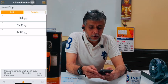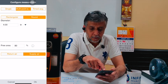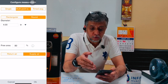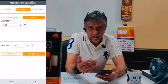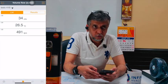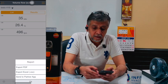To get the air quantity directly, you input your diffuser area by pressing the configure measurements option. It supports single or multiple measurement points — useful if you have an AHU and want to take multiple readings on the filter side; it will calculate the average for you. You can select a rectangular or round outlet. I've entered approximately a four-inch diameter, and a free area of about 80% — that's total area minus the restricted area. You can also select whether it's a return or supply outlet.